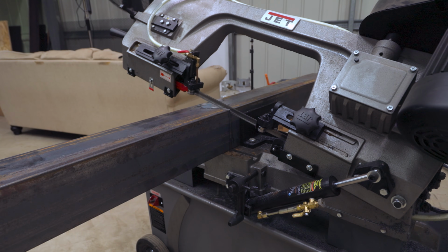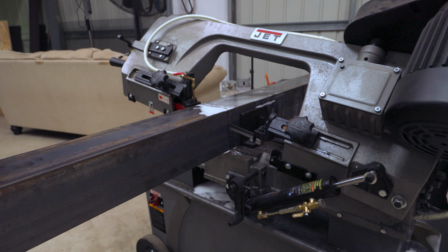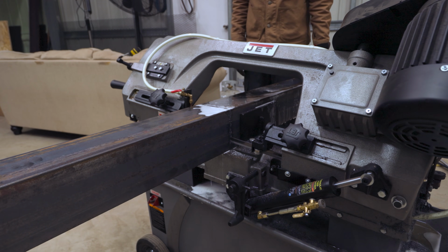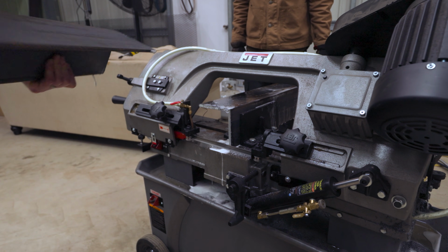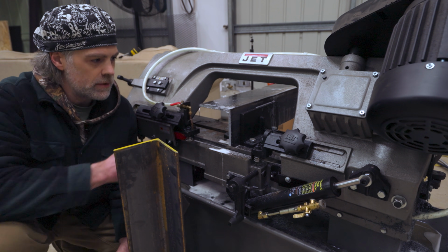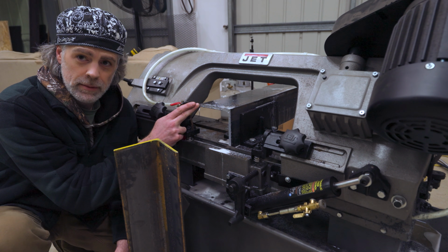When possible, I like to use any kind of scrap steel I have laying around for projects. I just happen to have this 5" by 5/16 inch angle iron. It seemed like a perfect candidate for this project. To create the main portion of the pedestal, my plan was to weld 2 of these pieces of angle iron back to back. When you go to cut angle iron on a bandsaw, like this is the best position to use when you're cutting it to get a straight cut.